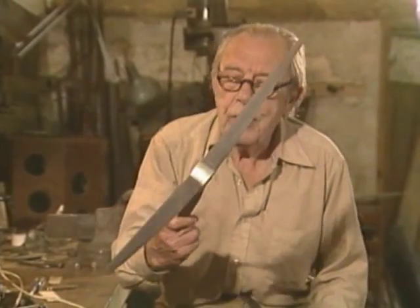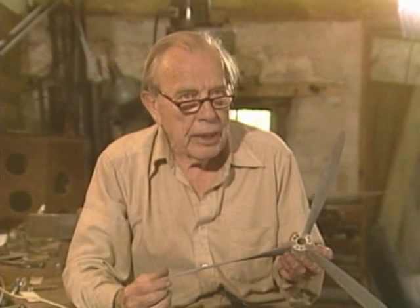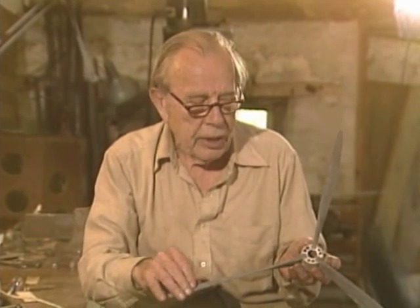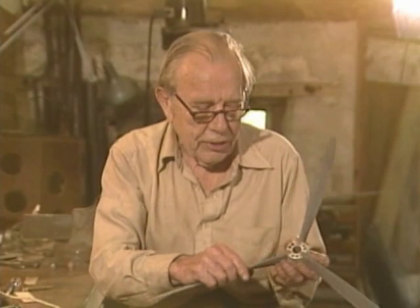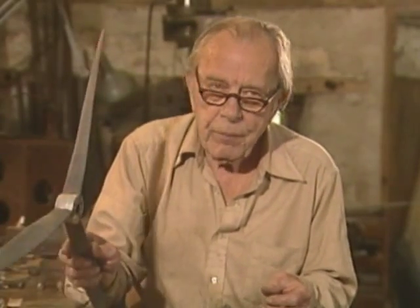I really found the stresses even greater than I thought. As an upshot of making at least three of these things that blew up, I finally got to this, which I've kept as a memento of those years. It's made out of forged magnesium and the blades are profiled on a profiling machine of my own manufacture. Forged magnesium has to be tempered just so, but it's really like hard steel - only one-fourth the weight.